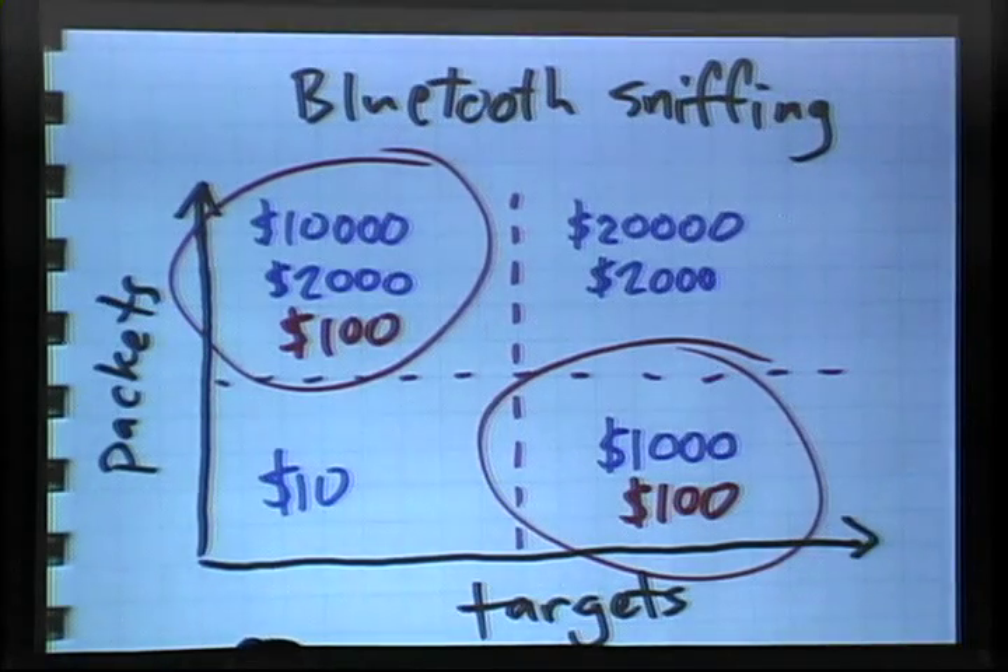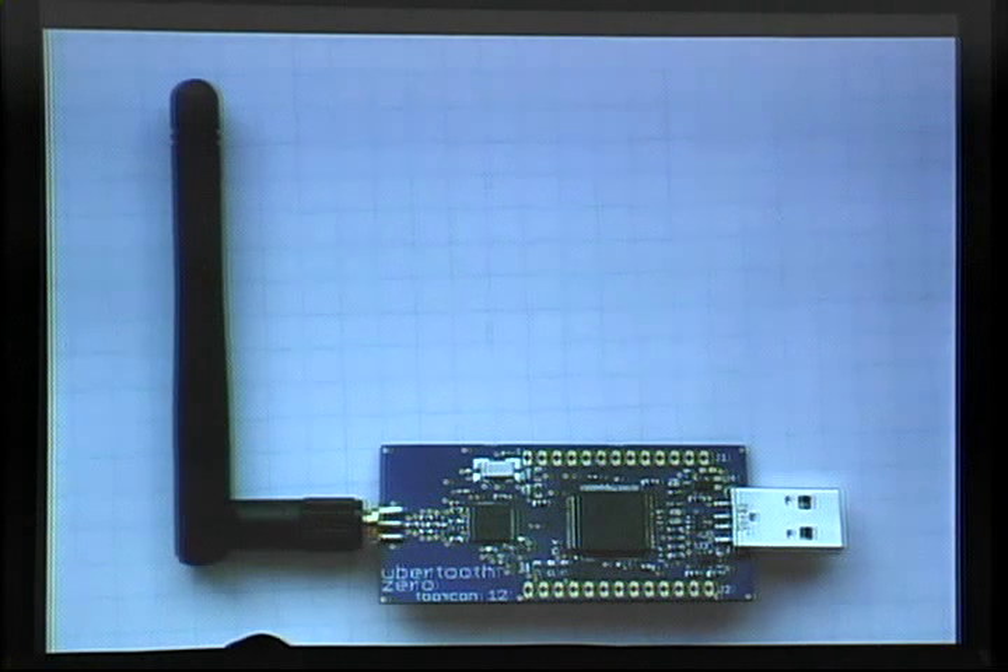I'm trying to do it for under $100. That's my goal. And it turns out this is absolutely possible. What I've built is a board I'm calling Ubertooth, and it is just a little USB dongle. It's based on the CC2400, which is a ChipCon series chip from Texas Instruments — the same series that's in the IMME, my favorite pink toy. It has a couple of capabilities unique among low-cost wireless transceiver chips. One is that it operates at 2.4 gigahertz and supports one megabit per second frequency shift keying modulation, which is the exact same modulation that Bluetooth uses.